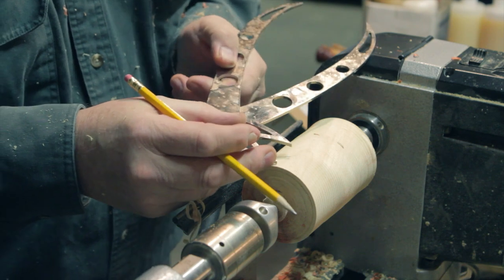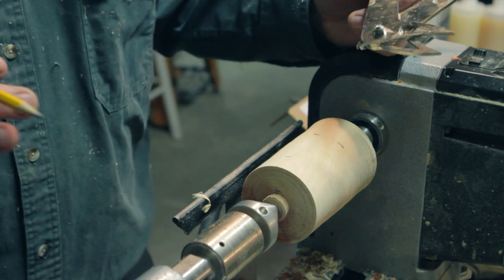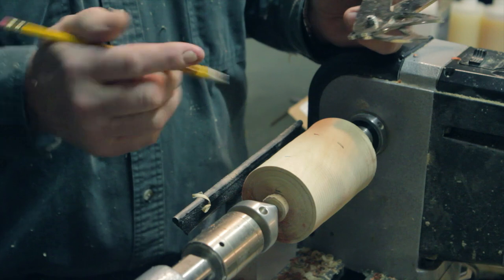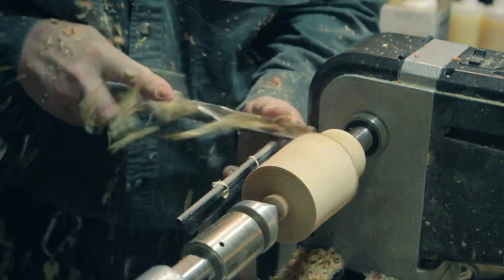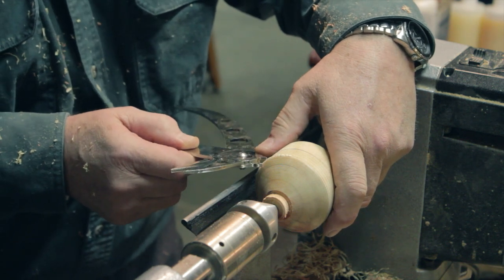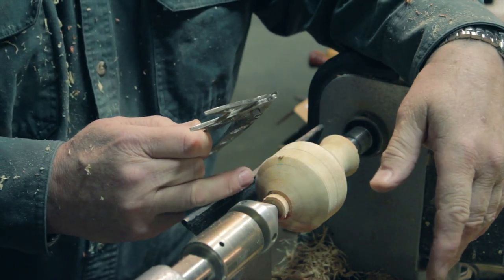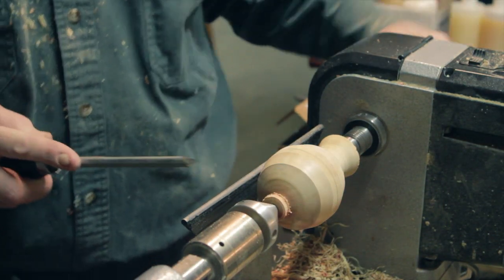What we've done here is mark out the locations to cut between to preserve the 45-degree tangent. Now I'm going to take it down on the other side, make the same marks, cut a straight line connecting those two positions, and we've taken our four-sided figure to an eight-sided figure. I've now marked out the positions for the 22-and-a-half degree radius tangents. When I connect those two lines with a straight cut, we've gone from a four-sided figure to an eight-sided figure, and now a 16-sided figure — and that's pretty close to right.